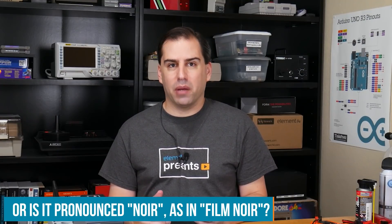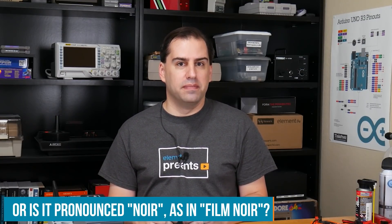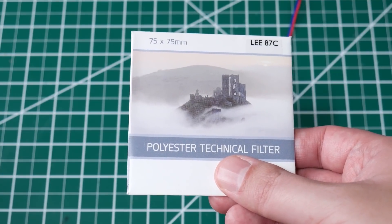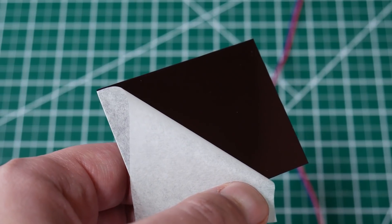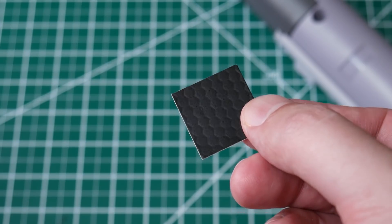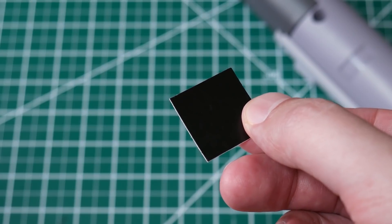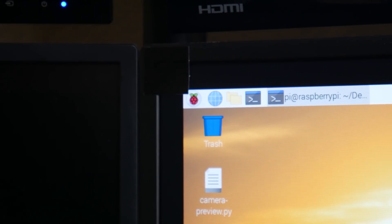We can't test the infrared LEDs with our eyes, so we'll use the Pi Noir camera, which is the same as the regular Pi camera but without the filter that blocks infrared light. However, we want to see only infrared light, so I'm adding a polyester filter that blocks visible light and passes infrared. After plugging in the camera, we can preview its output with a tiny Python program. Now let's check how well the reflective tape works — the hexagonal pattern suggests it's retroreflective, meaning it reflects light back to its source regardless of angle. Unfortunately, the tape works okay but there's a lot of glare straight off the monitor, which is going to seriously complicate the video processing algorithm. I need to come up with a new plan.